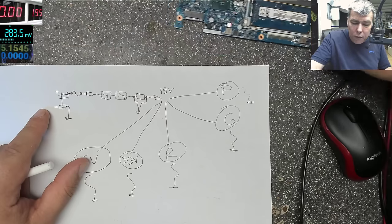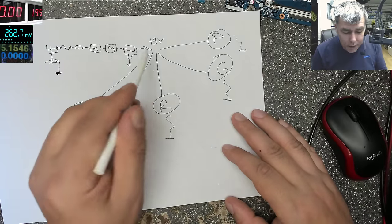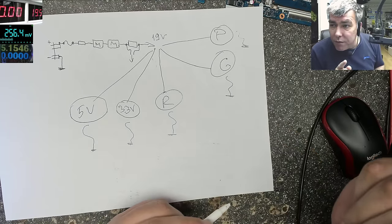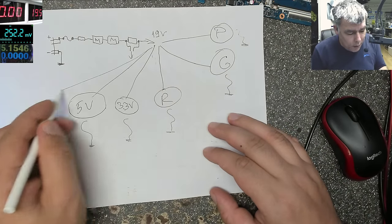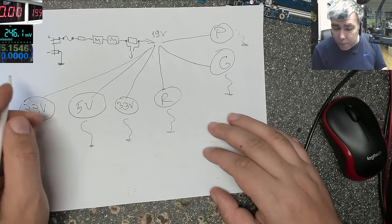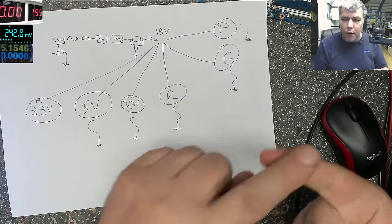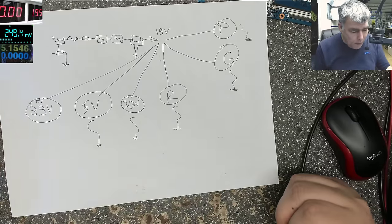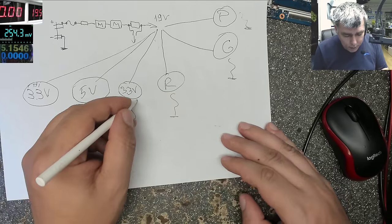What is always under the voltage on a laptop when it's off? When it's off, we have 19 volts everywhere. That's under the voltage. One power supply is running and is switching. The 3.3 volts one. Actually, on the laptop, you have two 3.3, a big one, 3.3 volts. This is high amperage, which is 3.3 for the Wi-Fi, for the hard drive, for the DVD drive, yeah, for the screen. And you have a small, low power one, for the chipset, yeah.